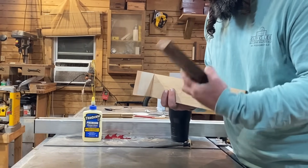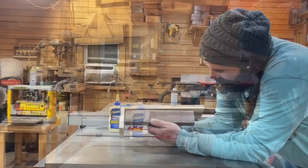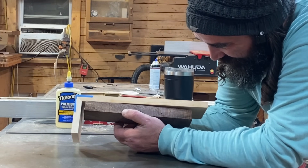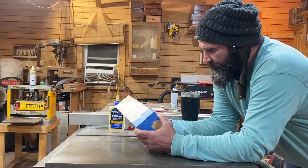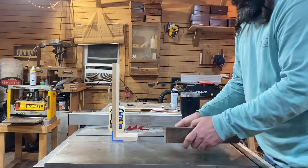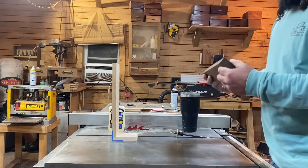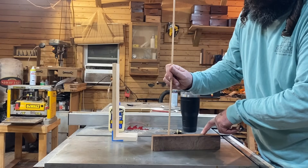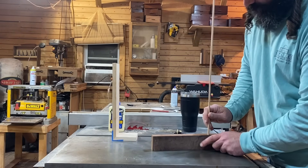While this is drying, I was supposed to be drilling this out for the magnets, and I just haven't been able to decide how I want this to sit in here — whether I want it like this or like this, I really don't know. I'm stumped, guys. Okay, so I've got it. We're going to go like this. So I'm going to go ahead and mark the center of my piece with my marking wheel, and I'm going to be using a dowel. I'm going to drill a hole here and here, then transfer my hole to my piece, but it's going to be a little tricky. Let's go drill out the hole on this piece for our dowel.